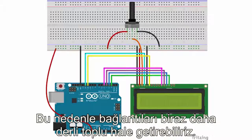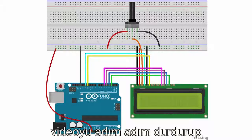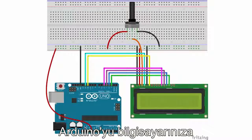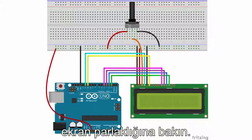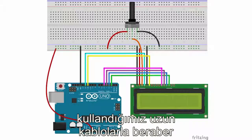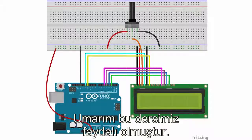If you haven't hooked it up yet, I recommend going back to where we start from the beginning, pausing the video at each step of the way, setting up each connection, and moving forward. Once everything is connected, plug your Arduino into your computer and it'll power up. The first test you'll want to do is to turn your potentiometer all the way one direction and all the way the other and watch what the brightness on your LCD display does. Overall, there are a lot of wires to connect, but that's what it takes to connect your LCD to your Arduino. I hope that was helpful and I'll see you in the next tutorial.